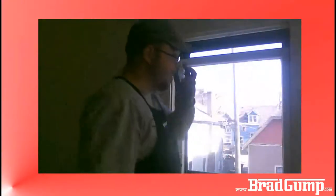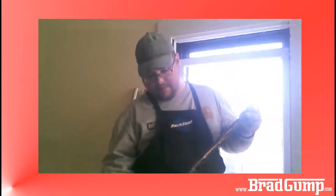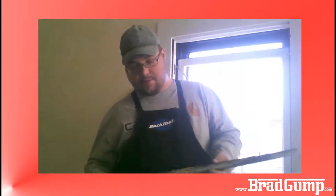We're back. At some point in time someone worked on this window. They split it down here, and rather than replacing it they spliced it together and drove the nails into the whole right place. With these, pretty much what you do is take your end nippers and pry those out. You can still strip them and clean them up — it just depends on the state of the parting stop. Since this is my father's unit, he'll want a new parting stop made for this one because it's pretty beat up along this edge. I hate making them, but it's part of the job.